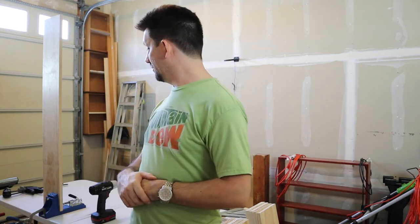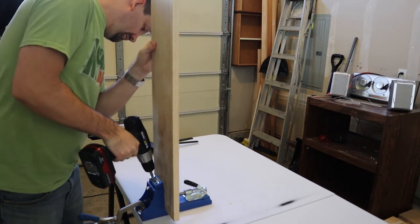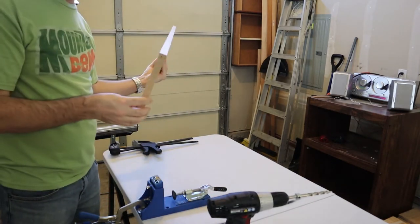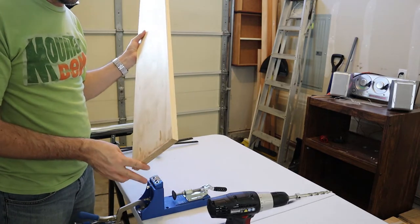Welcome back to day two. We are going to be doing a Kreg jig into the shelves themselves to be able to have screws go at an angle. Best way is just to watch — it's hard to explain exactly what's going on. But you can definitely buy a Kreg jig online, on Amazon, or at your local hardware store. They work really well. They kind of help you flush boards into your frame. The fun part about this is you've got to do tons of these — every board, both sides. So I'll probably fast forward through some of this video and let some music play.